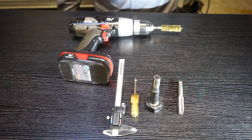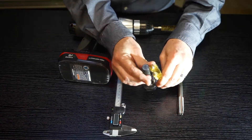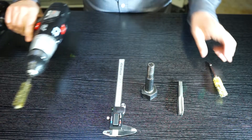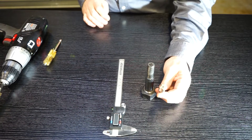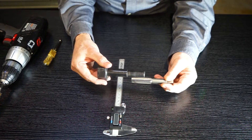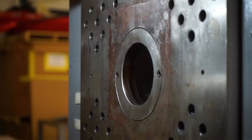The first thing we're going to need is a brass bristle brush — not steel, but brass — roughly the same size as the bolt going in the hole, and some type of cordless drill. We're going to put that in there and use it to clean out the threads and get all the gunk out. The next thing we're going to need is a tap, preferably a flat bottom tap so it goes all the way down. Make sure you have the right tap for the bolt — if you don't know how, ask your maintenance guy.